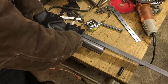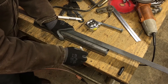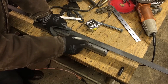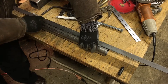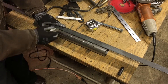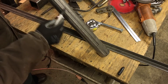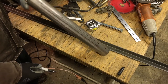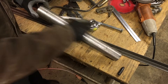I have some marks on here that I'm matching up with — I'm going to turn this around so it's a little easier. I already marked one mark here, I'm going to mark another one here, right about — of course my marker is having trouble because it's so cold — right about there. So all I do is hold the angle iron against the tube. Now I have marked a nice slot whose edges are totally parallel to the edges of the pipe. If I sight down it, that looks pretty good. Now I can go ahead and cut this piece out and I'll have a perfect slot through there that is straight along the length of the pipe.